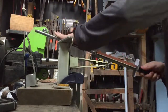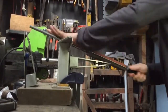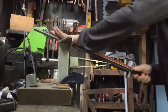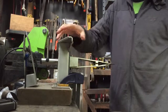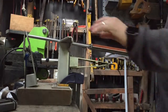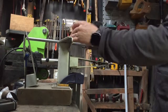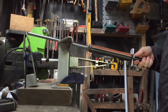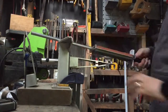But what I'm doing is essentially using a sharpening stone and a guided system. Now this is set up around 19 degrees. It's a New Zealand made invention. It's called Scary Sharp. Essentially what it is, a stone that's resting in a set position. I can change the position, 3 different positions. One is basically for chef knives, 2 is for general purpose hunting knives, position 3 right at the bottom there is for machetes or gorse choppers or similar sorts of things. I usually use this middle section and the top section.